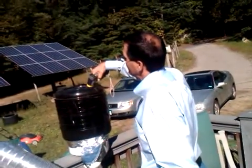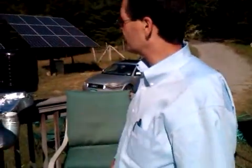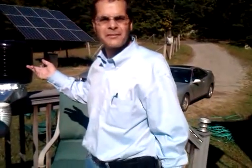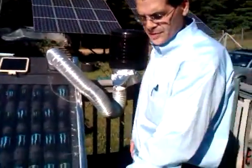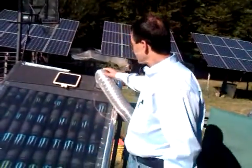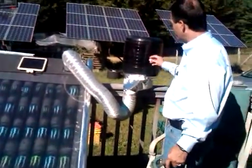So it's at 87 degrees right now. If we let it settle, it'll heat all the way up beyond 100 degrees. Where did you have it before, Greg? It was probably about 90 to 100. Okay. So we got 80 degrees going in, about 150 degrees at the header, goes through this tube, and dries the food.